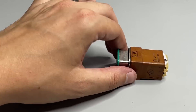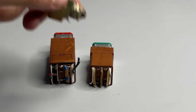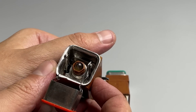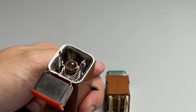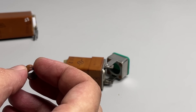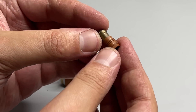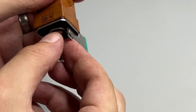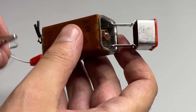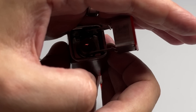They normally come in five colors — red, yellow, green, blue, and white — sometimes darker or lighter. The shorter ones are momentary, while the longer ones are toggle switches. They are technically based on two microswitches, which are very reliable. Here is one secret you probably didn't know: if you open the cap, you will find a light bulb secured right in the center. You can also change the caps to a different color. This light bulb is typically used in aviation equipment, so it requires 27V. It is possible to replace it with an LED, but that requires some modifications to the pins. So these buttons at the power plant panel are not only buttons — they are also indicators, and they are pretty important.